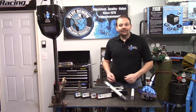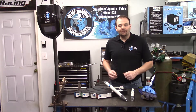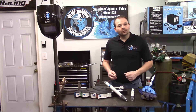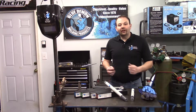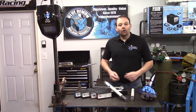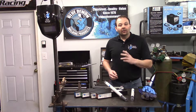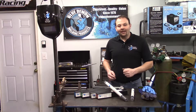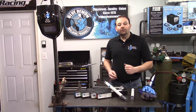ENI 99 is designed for welding gray cast iron or cast to dissimilar metals such as mild steel or stainless steel. ENI 99 is very machinable, so often weld specifications will call for root and fill passes with ENI 55, then cap with ENI 99. The ENI 55 will be stronger and more ductile, where the surface will be more machinable using ENI 99.